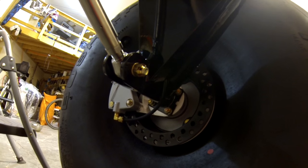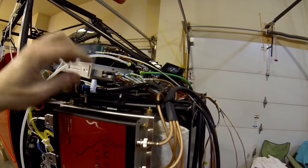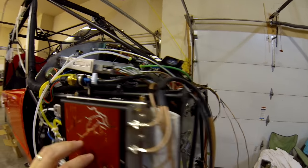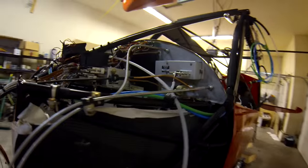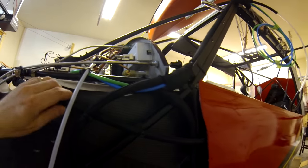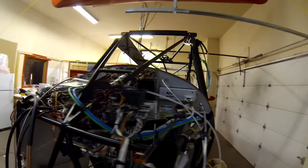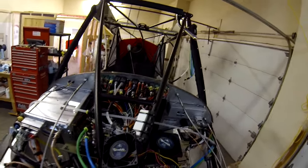This is where you connect your aileron cables. I still have some cotter pins to put in — there weren't enough of the bigger ones in the kit so I've got to buy more. The brake line runs underneath this way — that's the shortest run for it. One thing to point out: the fuel line has to be on top of the bar because it has to clear the panel on the other side. They have the wire run underneath with a notch, and I'm not sure why they didn't do it the same way on both sides, but it does work.